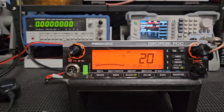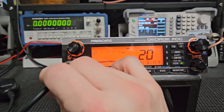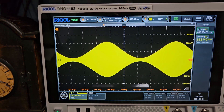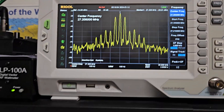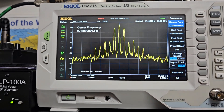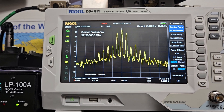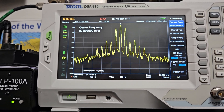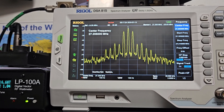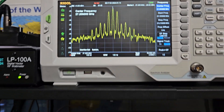It's a simple thing: just don't do it, and the power will stay closer to the frequency you're on — which is what we want. We key up with the 1K tone and you can see the radio is pretty much spot-on, with a nice modulated envelope. We still have tons of spacing on either side, so there's literally no chance of causing bleed-over unless maybe someone's in the driveway. Across town, you just don't want that power spreading.